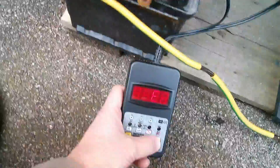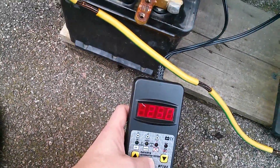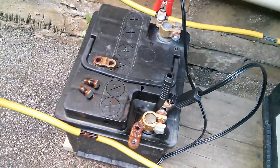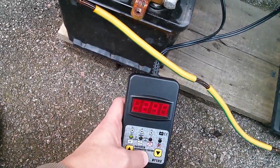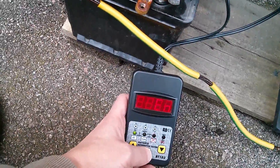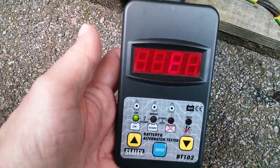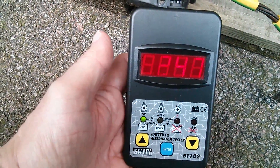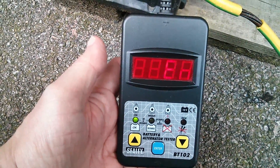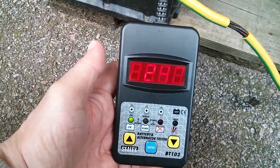CA appears to be cranking amps — marine cranking amps — while all the others are cold cranking amps, which is the normal measure. I've got no labels on this battery, so I'm just going to go for EN. Then you enter the actual cranking amps of the battery — again, I don't know, so I've just put in a default of 250. It runs the test and that's come up as 247. The little green light has come on, so it passed — because I told it the battery was 250 amp CCA.